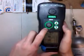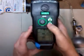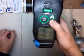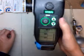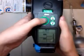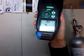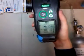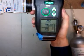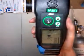There are three buttons on the monitor: the accept button, which is the large one, the page button, and the reset button. To begin calibration, hold down the reset button. It will beep once, then beep again and display 'Cal Zero.' Make sure you're in fresh air and hit accept to set the monitor to zero. It will go through a zeroing process, showing 20.8% for oxygen, zero H2S, zero CO, zero LEL, and then give you a pass before prompting a span cal.